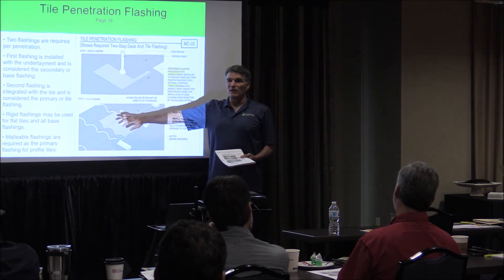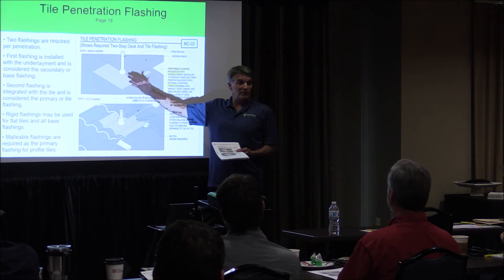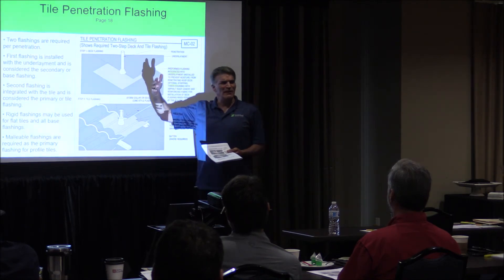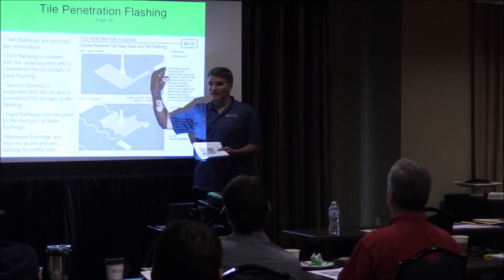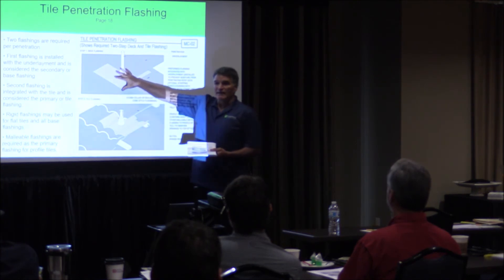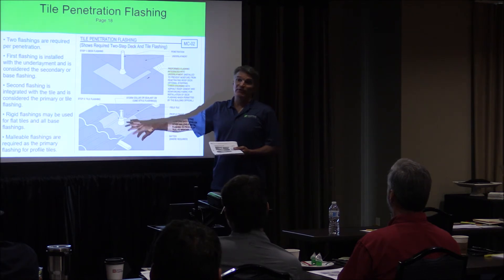When we go out on a roof, we tell our roofers to treat it as if the underlayment is the roof. We treat it as if the underlayment is the roof because it's going to be there for a week or two or maybe a month before the tile gets installed, so we want it to be watertight. We use no caulks. We put no caulks on those, just like you put on an asphalt shingle. We go right over the pipe and integrate that into our underlayment. We use gravity and flashing because it lasts forever, where mastic will be great but has limits. That's a watertight system. Then when we come to our tile, we pretend like we're on that open space sheathing deck and there is no backup system — we have to have a waterproof roof that will protect the house. We put on another flashing integrated with that tile roofing.